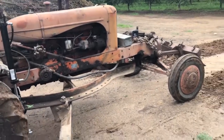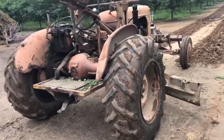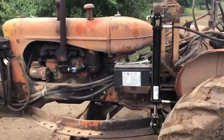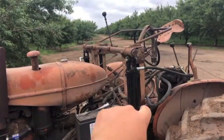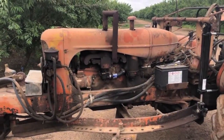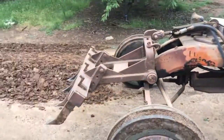Just a little background on this — this is a 1945 Allis-Chalmers speed patrol, that's what they called it. It's a road grader, a little bit modified. My grandpa bought this brand new, I believe — I'll have to double check on that. Instead of having hydraulic cylinders to move the blades up and down easily, it had these big wheels up where the driver stood and you had to manually pull them to lower and raise the blade. So my grandpa, one of the first things he did, he installed a belt-driven hydraulic pump.